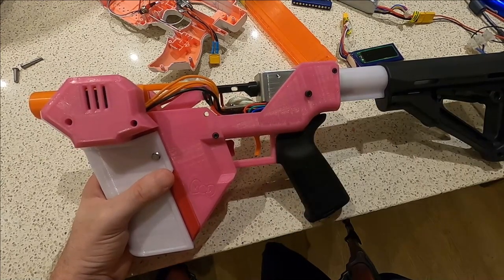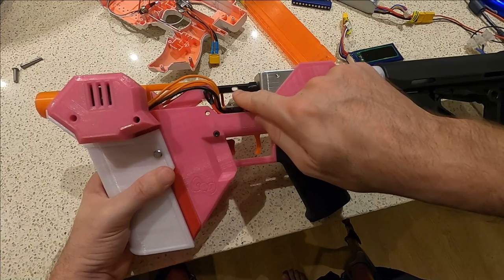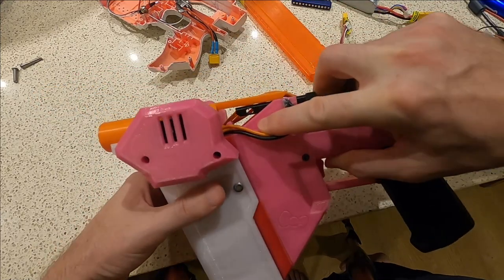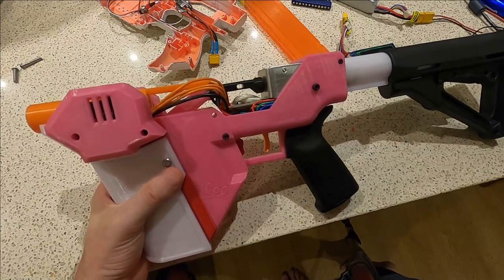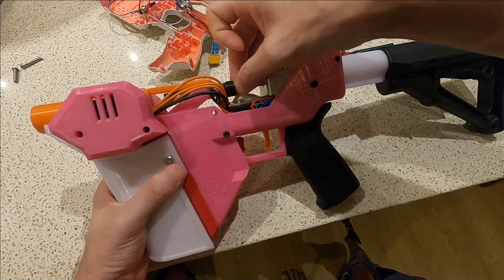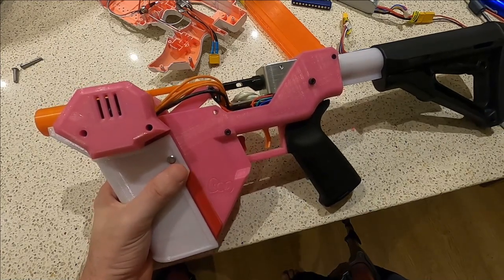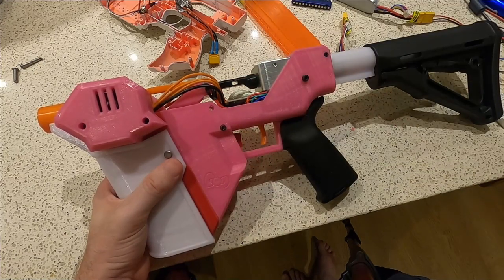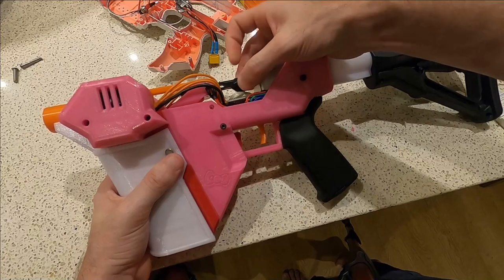The receiver is on one side and the sender on the other. It shines a beam of light through a hole in the pusher nub. This is towards the fully extended position. The hole doesn't extend the whole way, so when pushed in manually you can see there's another hole. In this one pusher there are two holes, meaning it can be in two possible states - retracted or extended. This is a convenient setup when the pusher nub or arm is longer than the stroke of the solenoid, so you don't need a lot of additional electronics.